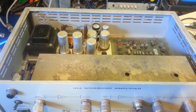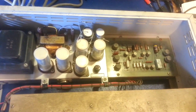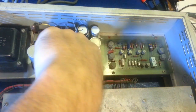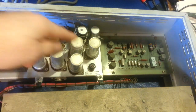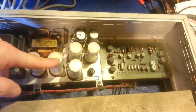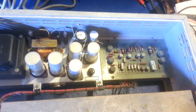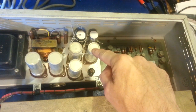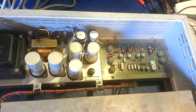I get the feeling it might be that transistor down there. This thing's old school - a very early solid-state unit that does use a vacuum tube. So there's the transistor I was talking about. There are lots of big can capacitors, and they're really big by modern standards - this thing's what, 150 microfarads at 80 volts? That is a gigantic capacitor for only 150 microfarads at 80 volts. This one here is 500 at 35 volts, this is a dual section - 2500 microfarads at 35 volts, same thing for this one. They're low voltage caps; there's going to be one higher voltage cap in here somewhere because we do have one vacuum tube in here.